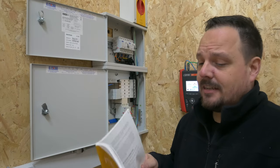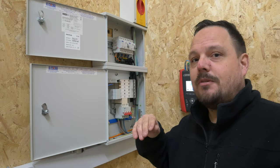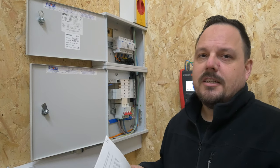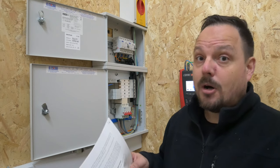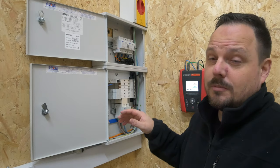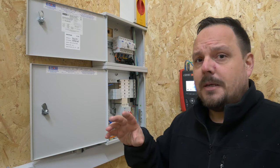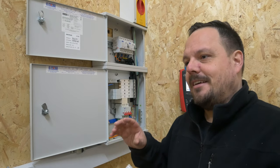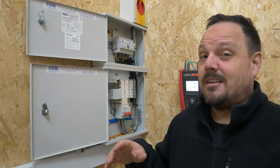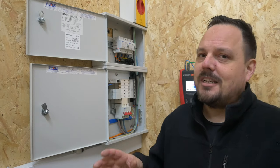Just a last look at Guidance Note 3 — it's the RCD uplift element. If you are encountering a higher value of ZS than you would expect, there is a known phenomenon between some brands of RCDs and some test instruments where it can add half an ohm or more to some of the values. You can raise awareness of that yourself on the installation by measuring at the load and supply sides of the RCD — it will give you a rough approximation of what's going on internally. It's just a measurement of phantom impedance between the device and the testing instrument. A lot of modern test instruments now factor that in and are pretty accurate regardless.